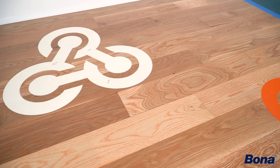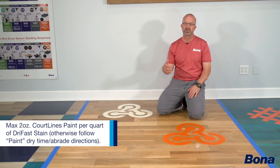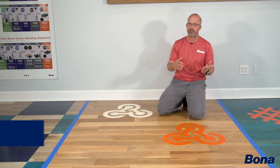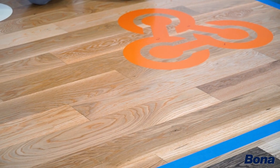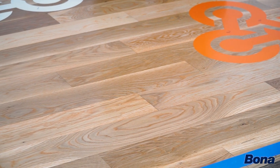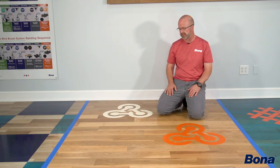Whenever you're doing that, we don't recommend any more than two ounces per quart or eight ounces of paint per gallon of stain. If you do use more than that, understand that your mixture is now acting more like paint than stain — so follow the Courtlines paint instructions, which include a 24-hour dry time, then abrade it with a maroon pad before putting sealer, paint, or anything else over the floor.